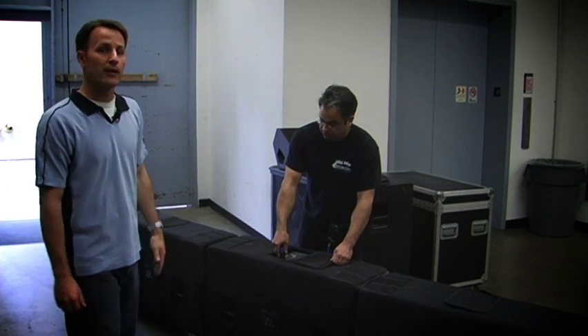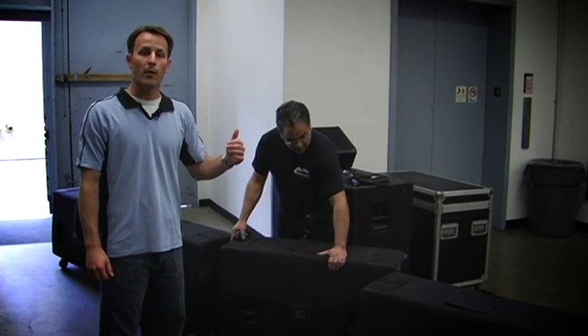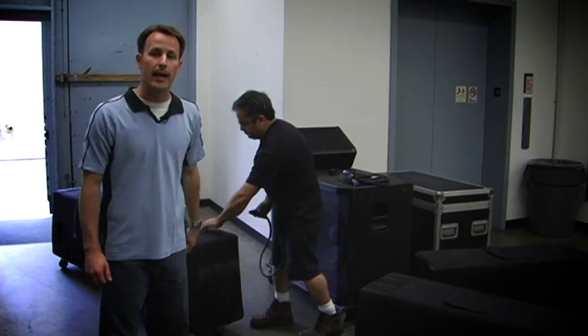Right there, we find out that we've got a bad low-frequency device. We can take care of that in the shop, swap the speaker out, or replace it before we even get to the gig.